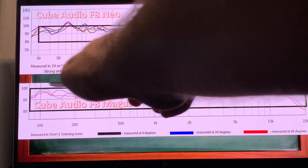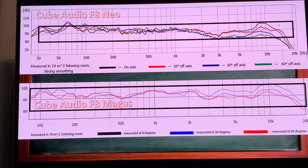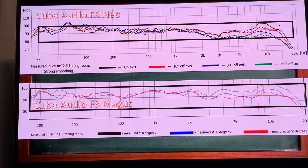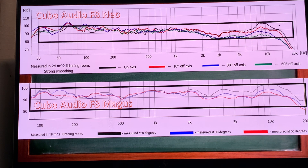The mid-bass will be higher, so it won't be a mid-bass-shy loudspeaker and will sound good with strong bass. It's just the upper bass and lower midrange that will have a lack of energy compared to the main energy of the driver. That gives it a little bit of leanness but also a speedy sound — still a pretty decent, good curve, with a solid 96-97 dB average efficiency in the region that counts.